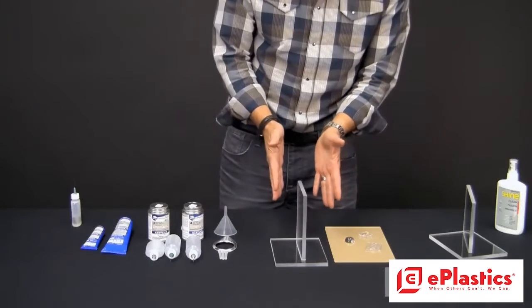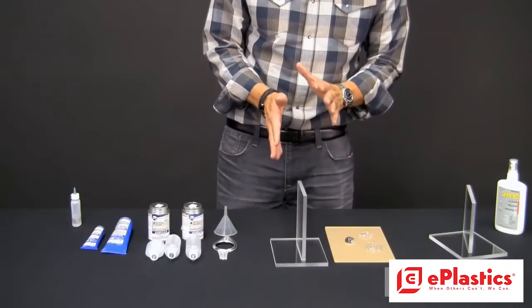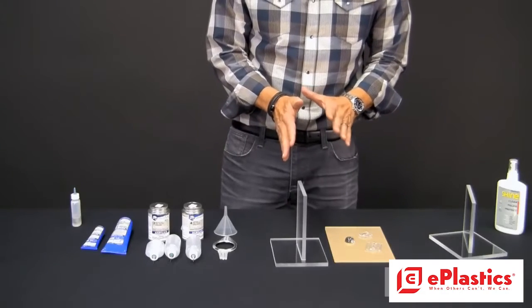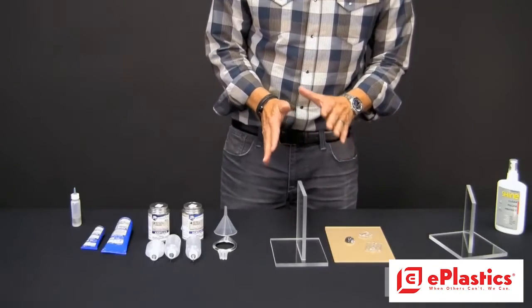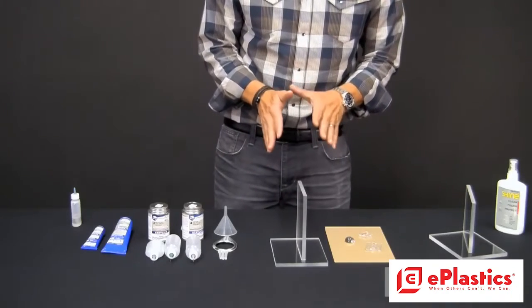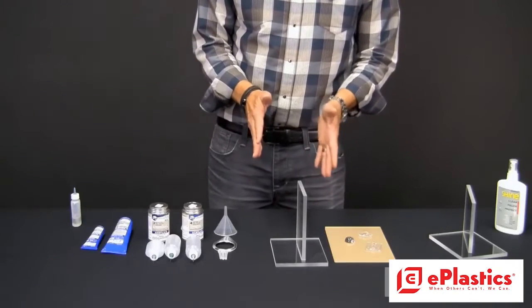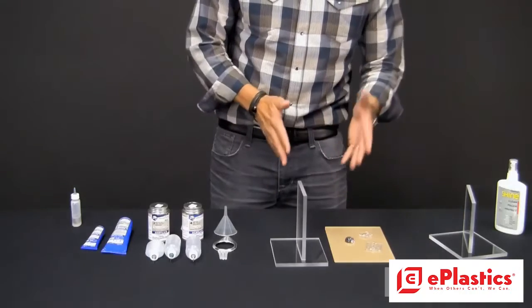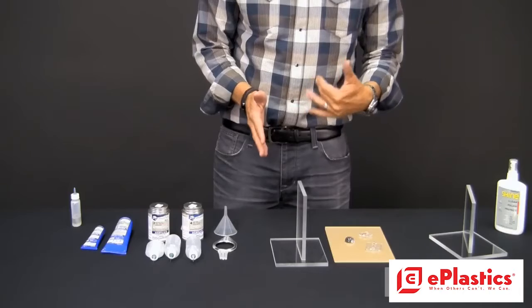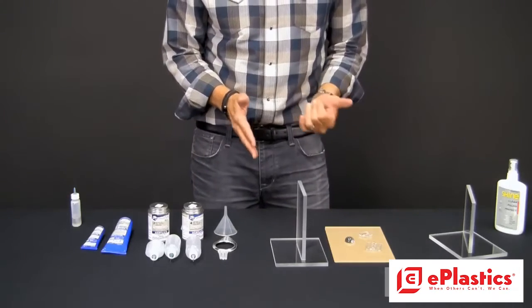We've got our piece that's glued. You've got to let it wait 10-15 minutes before touching it or moving it. Even though after just a few minutes it feels like it's bonded well, adhesives take a full 24 to 48 hours to be a complete bond. So you get a lot of grip in the first couple hours. In fact, you can actually handle it within an hour or two, and then maybe turn it and glue some more pieces to it. However, before really testing it to see how strong it is, you've got to wait 24 hours. So that's overnight for most people.